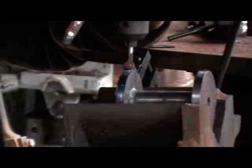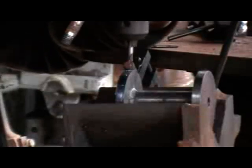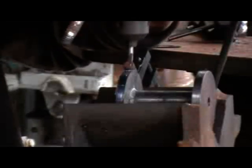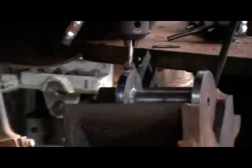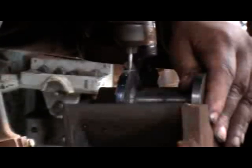This is the setup for drilling the spoke holes. The angle plate is tipped up at a degree to match the angle of the spoke meeting the center of the rim. The center drill is to start each hole on the dot. And the spindle — or bobbin — is held in place so it just requires turning to achieve the same result for each hole.